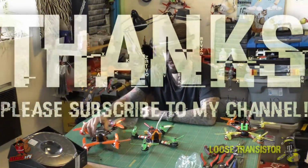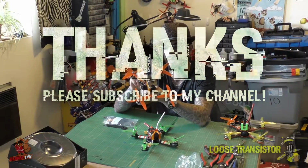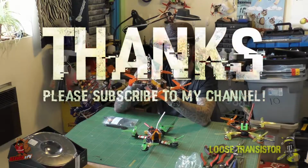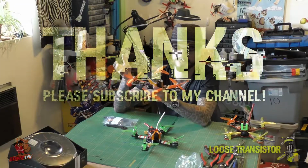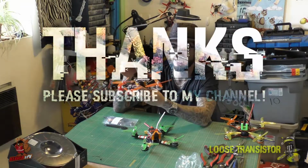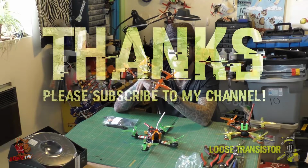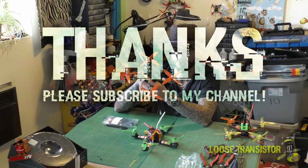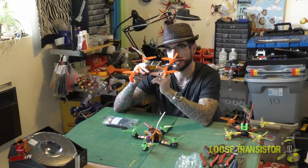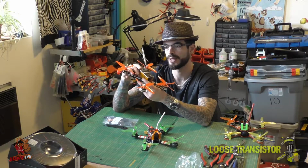In fact, this quad right here from Detroit Multirotors, a WP17 Stretch X 5-inch. This was actually one of the first quads that I did a build and review series on, and I haven't really revisited it since. I did have some problems with this quad in that for it to stay stable and not nod, I had to run really high I gains, like over 130, especially on the pitch. And what happened was that, yes, the quad flies, but it doesn't feel good. It feels rigid and weird. I don't know. I did not like it.